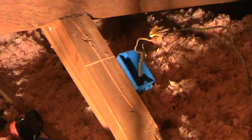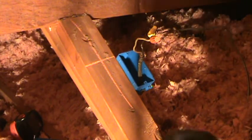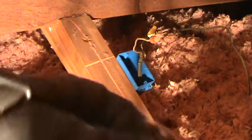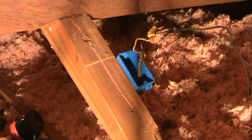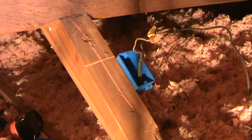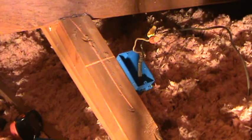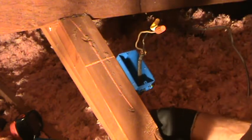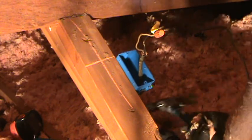Now I'm going to grab some staples and attach the side of that cable. Here's the little staple — it's for 12 gauge and 14 gauge wire. Sometimes people stack one on top of the other if you're running lots of stuff; then you might want a deeper cable staple. I'm going to hold it here on the side of the box, put it over the cable, hang on to it, tap it in — and then six inches from the box.